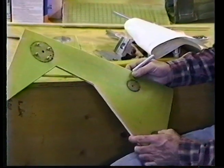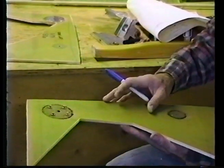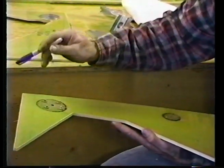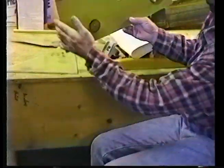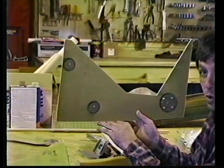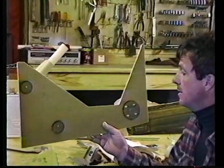Attempt to cut the scribe line in half, leaving one half of the scribe line on the part and the other half cut away by the blade. After you've cut them, place them one over top of the other and check their fit. You can actually do that prior to cutting. The holes are all match drilled on a quarter inch thick aluminum drill jig with drill bushings in it. The scribe lines, if cut correctly, will set you up with this portion of the bulkhead against the F10 or the canard bulkhead. This will go against the inside skin of the fuselage. It will not sit on top of foam core. If you find there's foam core in that area, you'll remove the foam core until it's just outboard of the NG30 bulkhead. We'll show you that in a little bit.